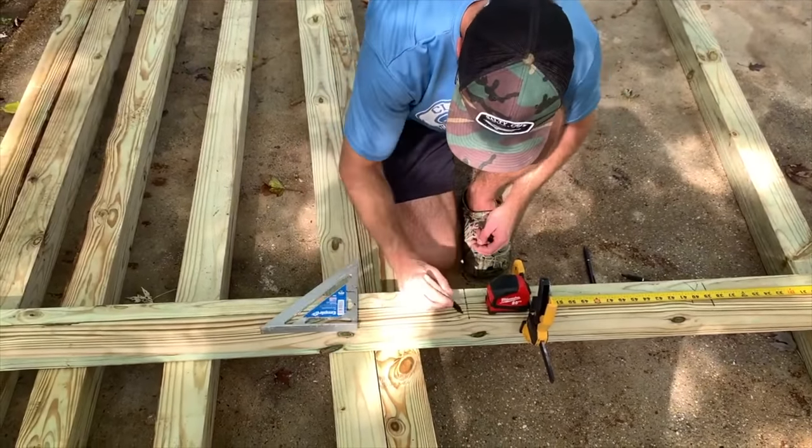So at this point, I've installed all of the 8-foot full segments of ProSlat. Now it's time to go back and install the partial segments. So what you're gonna do is you're gonna trim your bottom J trim to size using snippers. As you can see, we have this corner here. So I cut one corner and then cut the other side of J trim to fit within.